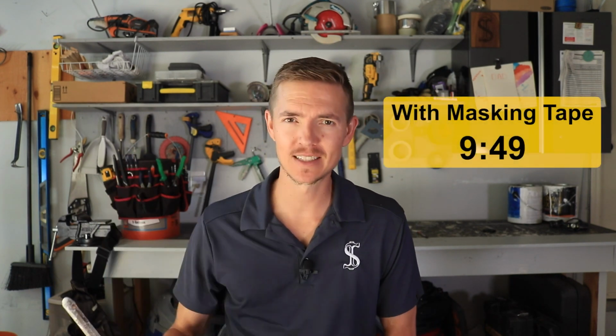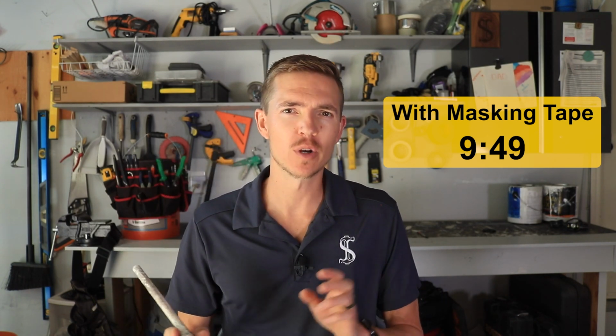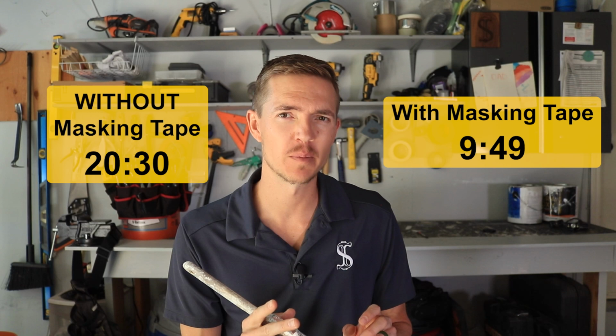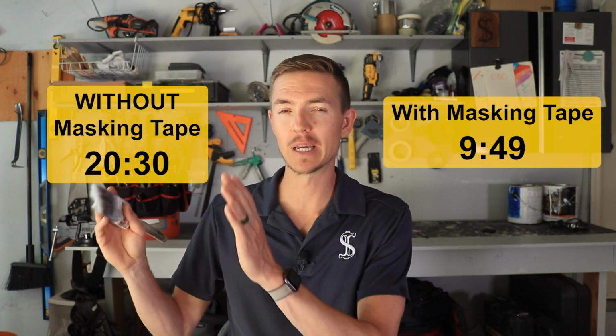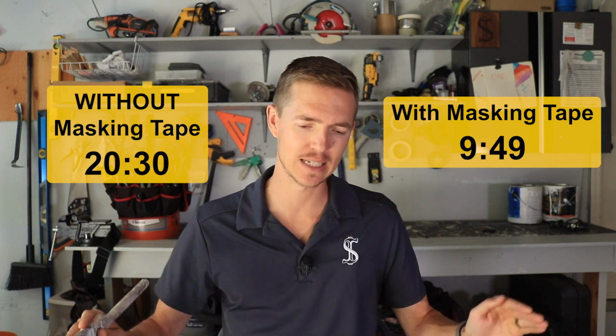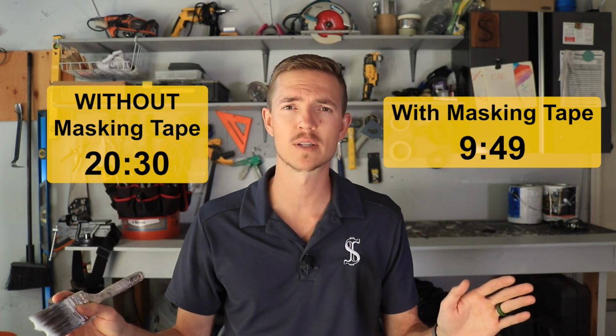All right, so what's the conclusion? Well, using masking tape was way faster. In fact, it was twice as fast. It took less than 10 minutes to apply the tape, paint 2 coats, and then remove the tape, where it took over 20 minutes to paint without masking tape. Now, of course, that doesn't include the time in between coats. I cut that time out because that's irrelevant. That's going to be the same regardless of which process I use.